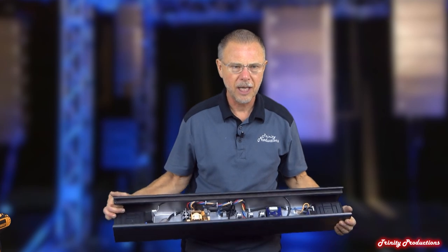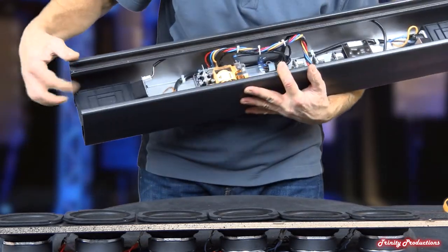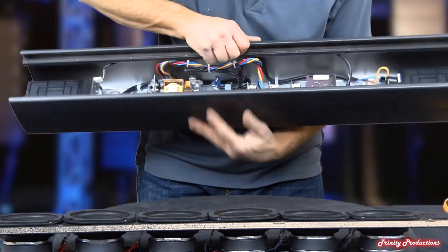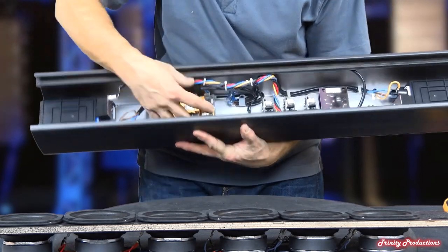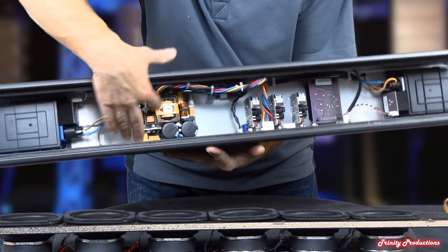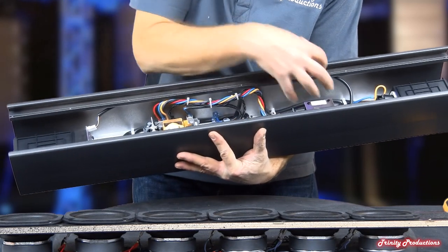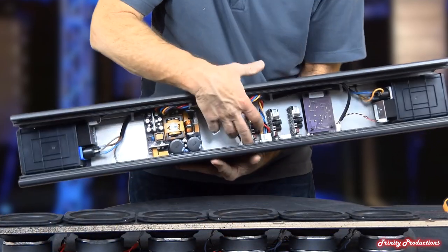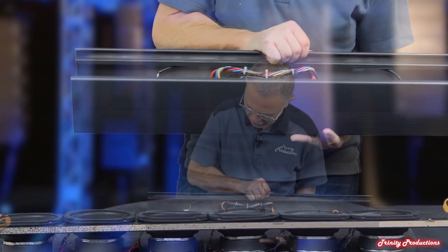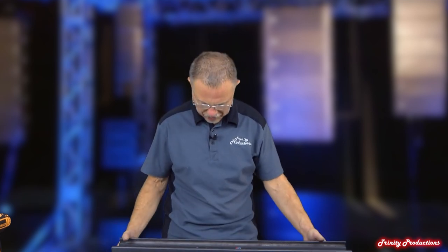This is an extruded aluminum case, and they've done a really nice job with the way it's all set up. Down here you've got power in and XLR, and on the other end PowerCon out and XLR out that feeds through on this cable. This is the SMPS power supply down through the center, and this is the amplifier assembly, all mounted on the back of it. It uses the semiconductors with the back of this unit as a heat sink, and they've also got it isolated on some foam with little standoffs. When this thing is fully assembled, you don't hear any echoey or hollow sound to it whatsoever.